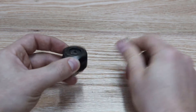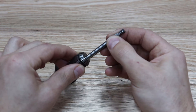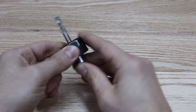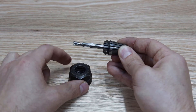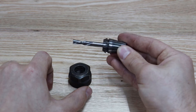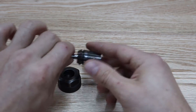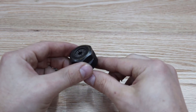You insert it after. If you were to take this and insert the bit into your collet first and then insert it, it does not snap — it cannot snap in place. And then what happens is this slips whenever you're routing out and causes lines to form on it, which in turn makes it off balance. Then it starts wobbling whenever it's spinning and that's not good. So first and foremost, make sure that you are snapping your collet into your collet nut first.